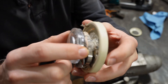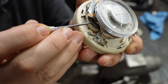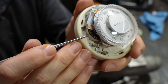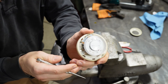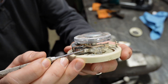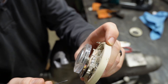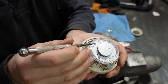One of the most prominent mechanisms is the mercury-filled tube, which is your switch. Then you've got this little spring that looks like a clock spring, but it's actually a bimetallic strip. They're made of any combination of steel, brass, copper, or iron. As this heats up or cools down, one side — say steel on one side and brass on the other — they heat up and cool down at different rates. As things heat up they expand, and as they cool they contract. So as it heats and cools, it rotates our little tube of mercury, and that mercury goes back and forth to either connect one set of wires or the other — turning your heat on or off. It's also got another bimetallic strip inside here that looks like a clock spring.